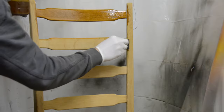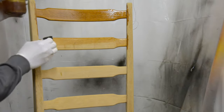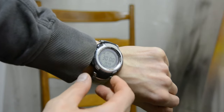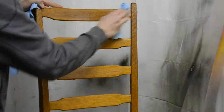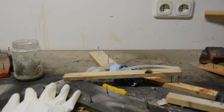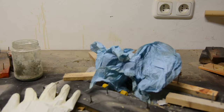The application is very simple — just use a kitchen sponge and put a generous amount of oil on the surface. Let it soak in for 30 minutes, then come back and remove the excess with a paper towel. Just make sure that the rags are spread out on the table and can dry out in the air, otherwise they might catch fire. The next day I repeat the process with another layer of oil.